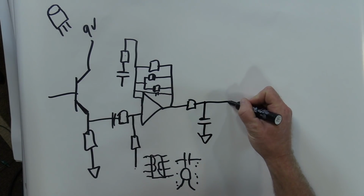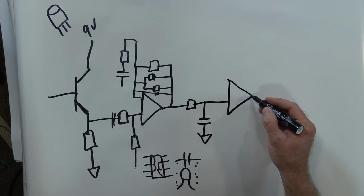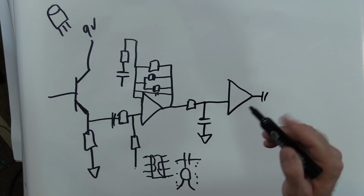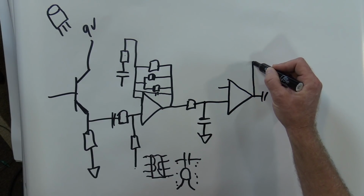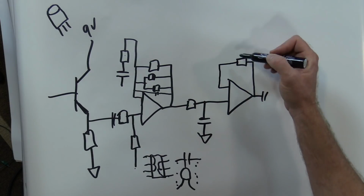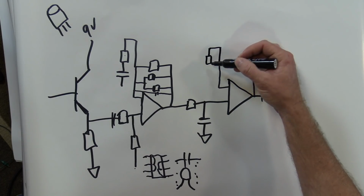After this, we go into the next stage, which is the other op amp, okay? And, all right, what that looks at is pretty unique, actually. So what this has is a resistor right there. Okay, see that resistor? That's setting gain. Remember that feedback there. We have a potentiometer, which is a resistor.